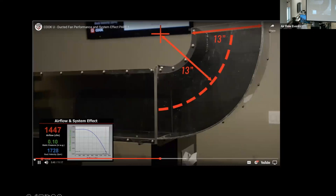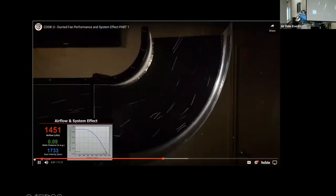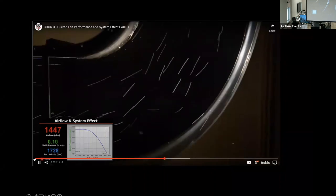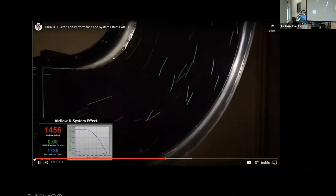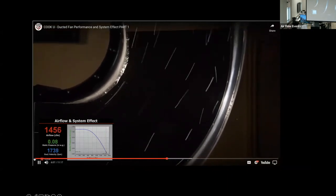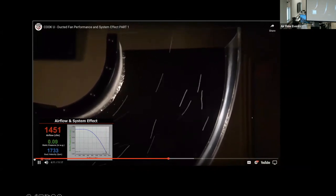As you can see, the pressure drop is very low, with an airflow just 30 CFM short of our baseline setup. We see very little turbulence in the fitting, reinforcing the result. Short radius elbows are compact, yet have minimal pressure loss. This elbow is also less costly than a square elbow with turning vanes. In this case, 22% less expensive.